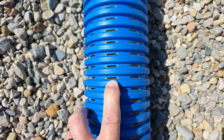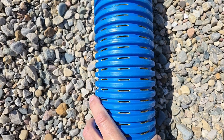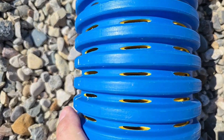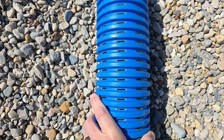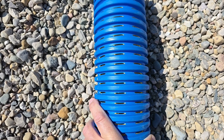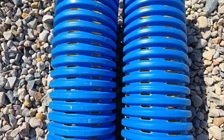When you add a second pipe and run two pipes side by side, each pipe could have its inlets 50 percent restricted and you would still be flowing water as if you had a single perfectly good pipe. When a contractor digs a trench wide enough to fit two corrugated pipes, you end up with a better french drain system.